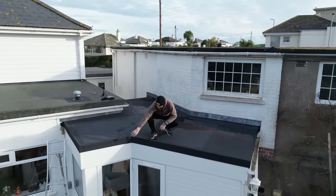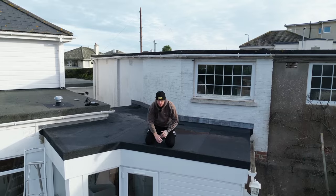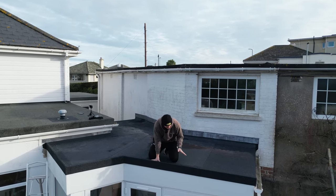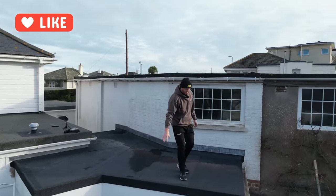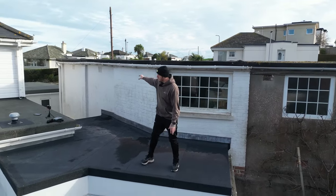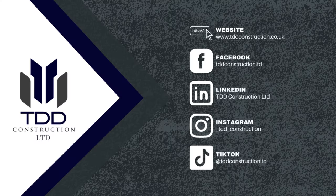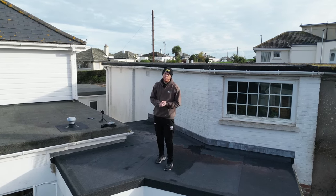As you can see we've installed this fascia along here — a 400mm fascia which we've ripped down. From here onwards it's level all the way through, so externally it's pleasing to the eye — just a flat level run. The roof itself slants down slightly so it went from 400mm to 360mm. The curbs going up here stop water running off the edge, keeping water on the roof and disposing it at the gutter point. We have a gutter run on this side and another on the other side — and that's a wrap. Drop any questions in the comments below, don't forget to like and subscribe.